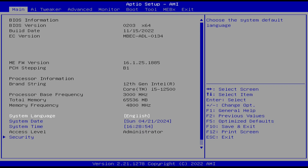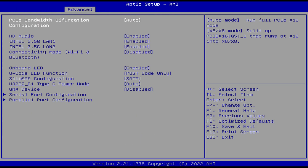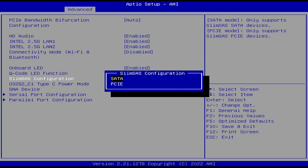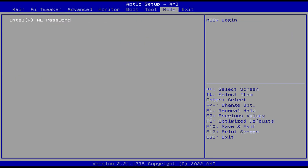The computer took a very long time to POST — if you're using unregistered ECC DDR5 memory, expect a long boot time, don't panic. Everything is already in and I'm about to update the BIOS, which was last updated in 2022. One thing I noticed: the slim SAS connector was set to PCIe in the BIOS rather than SATA as I expected from the documentation. That's actually potentially quite useful going forward, but for now I'm leaving it as SATA. The 2.5 gigabit LAN — what a waste; I won't be using it.